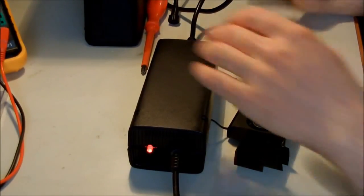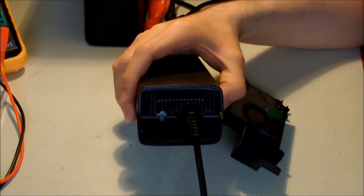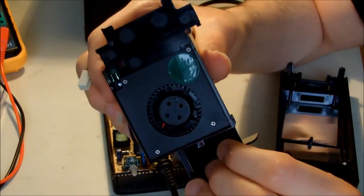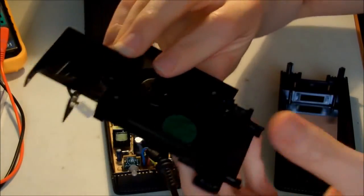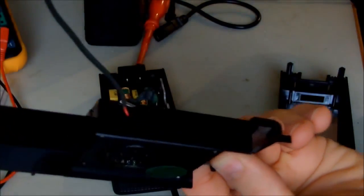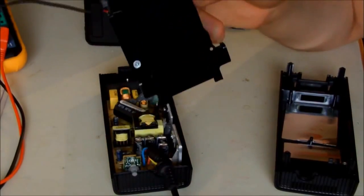First I have to tell you how to put back the power supply. So again, disconnect it and wait till the light goes off, in case it went off. What you have to do for the fan is just put the fan back and screw the two diagonal screws, the two big ones, and make sure that the vent holes are on this side. If you look at this, the cable comes from the side with the smaller hole, and the vent holes should be on this side. Just screw them with the two bigger screws that you saw in the beginning of the video.